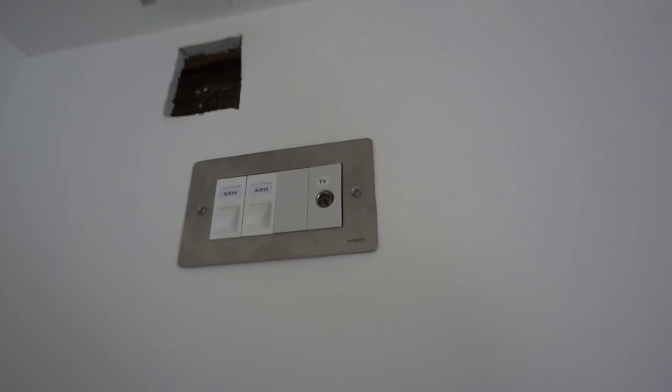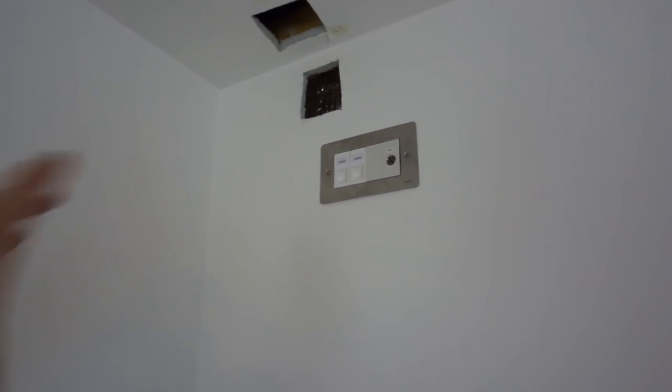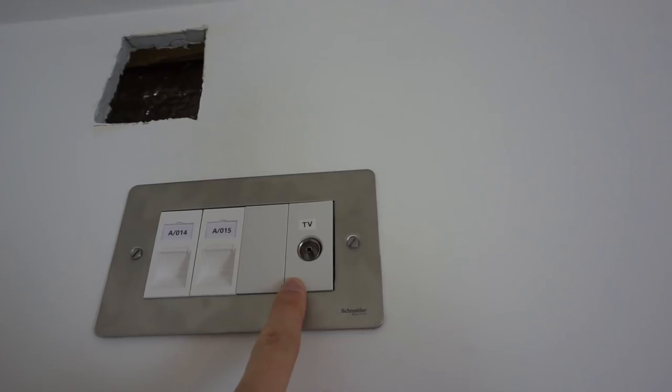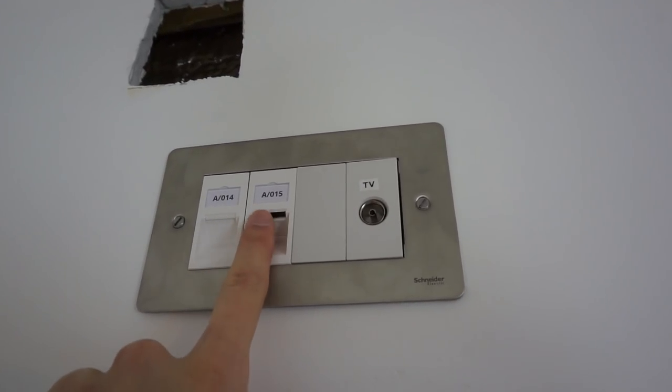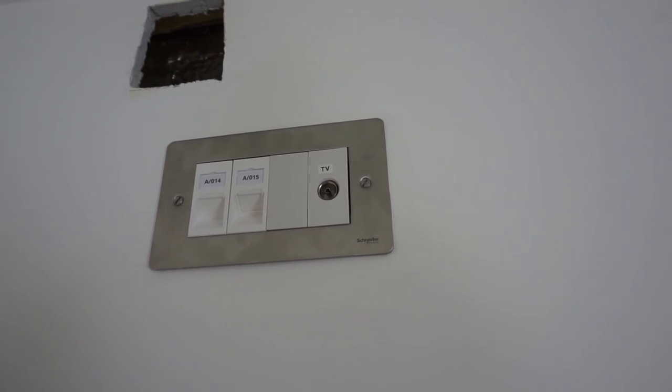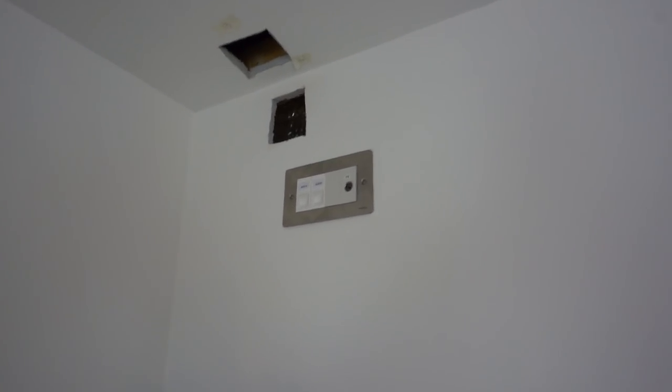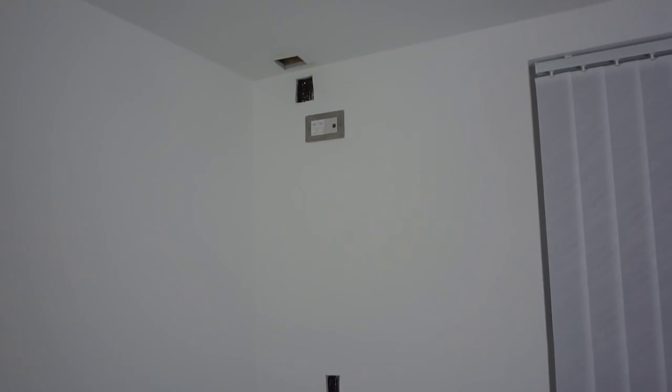Higher up the wall is where there'll be a TV — wall-mounted on an arm — where we've got a TV aerial connection going to the distribution amplifier, a pair of network connections for the smart TV functionality, and another one in case I've got a little mini PC to hide behind it. So that's the office — six network connections and a TV aerial connection.